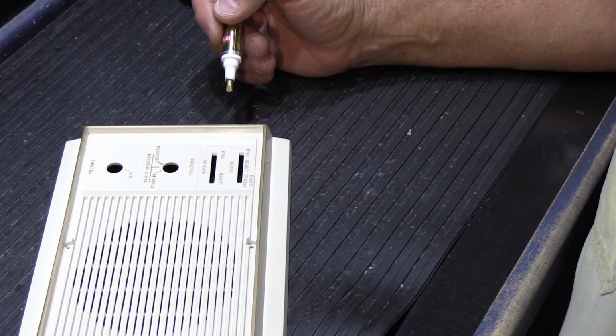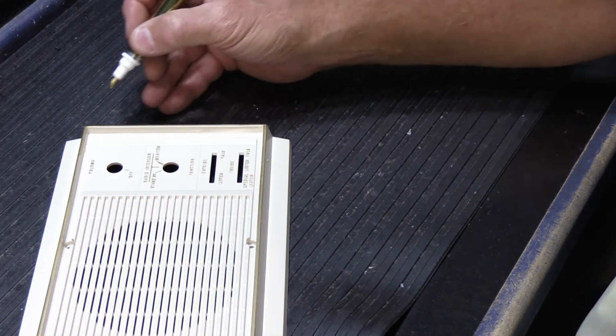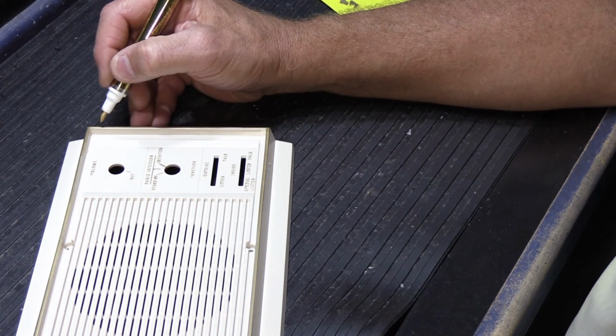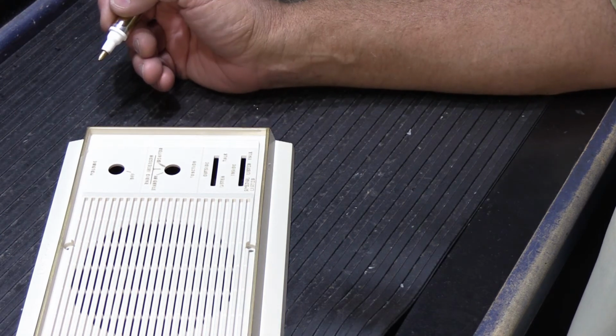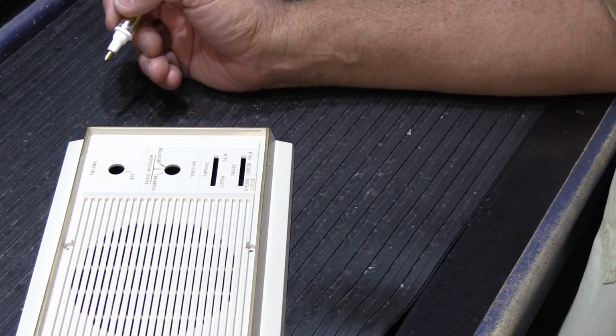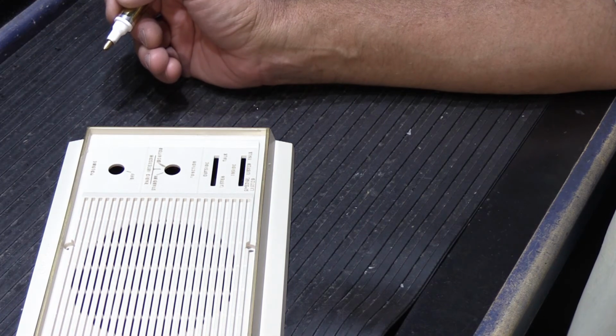If you try to rush it, if you wait an hour or 2 hours and it's not thoroughly dry, when you go to put on the second coat, it's going to drag the first coat up off the surface of the plastic, and it's going to get all clumpy and there'll be lumps in it, and then it ruins how it looks. So all of this is about patience. You can't rush something like this. You have to just go along slowly and carefully.